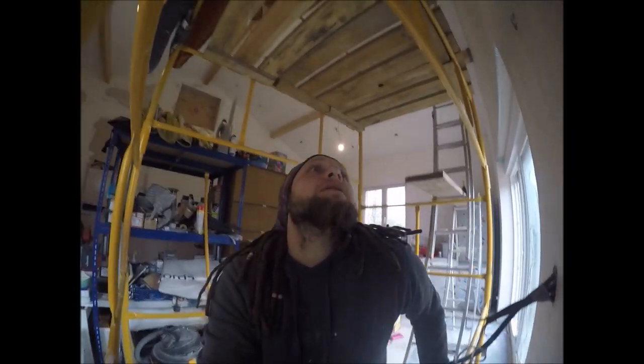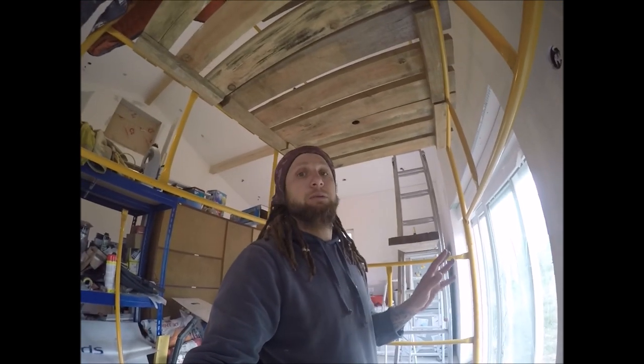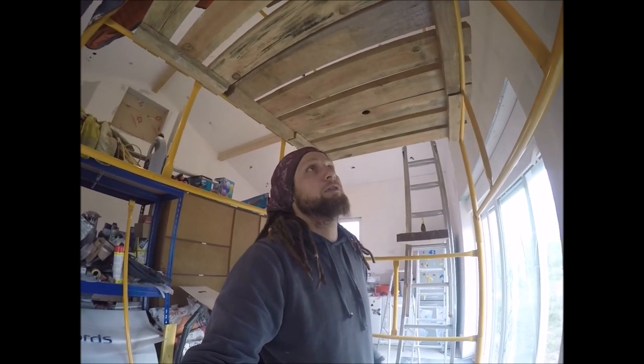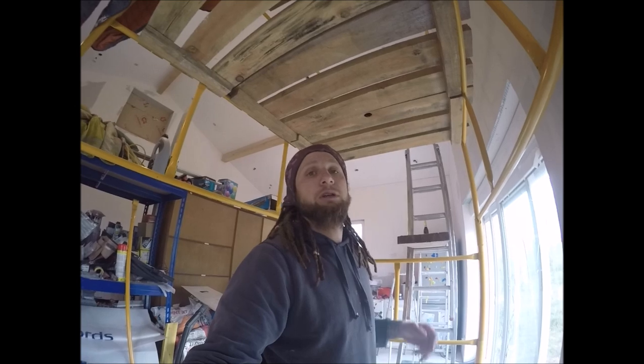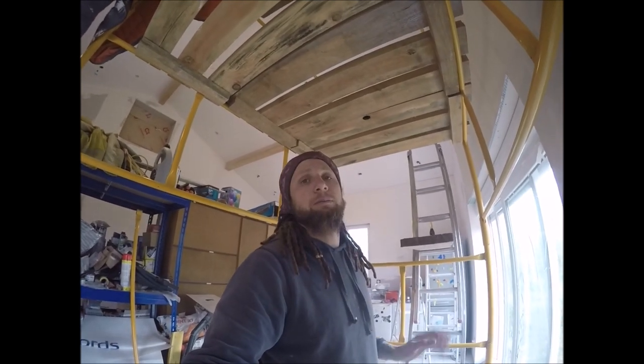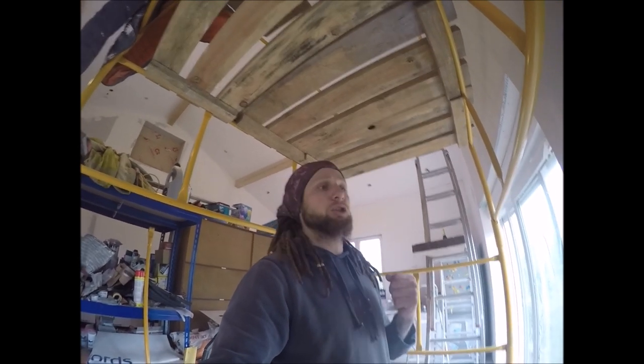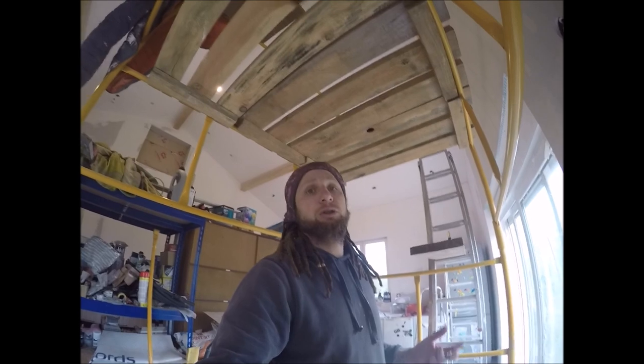And it's inconsistent as well, you get dry patches here, there and everywhere, and yet the plasterboard was all put on at the same time. It's brand new plasterboard, it's not been covered in dust or anything. We were chatting to a fellow builder yesterday about it, and he did actually say a lot of the time what they do is PVA the whole plasterboard again, or SBR it, because then that really controls the suction. But that's extra work, you shouldn't have to do that.